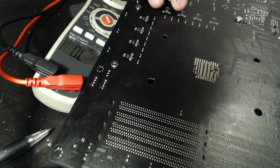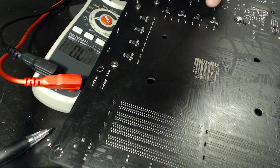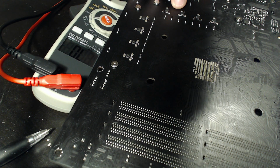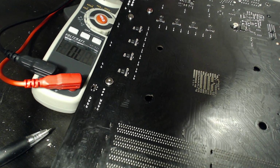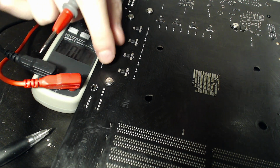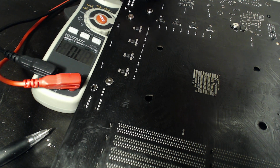And the first thing we need to do is identify Vcore. Now, we already know where the Vcore VRM on this motherboard is. You have these doubler driver chips right here. I think these are 3598s from International Rectifier. You have one PWM signal in, and then two drive signals going out of one of those. These four right here are Vcore, these two up here are also Vcore, and this right here is the SoC VRM, which is a doubled up 2-phase into 4-phase, and the Vcore VRM is doubled up 6 into 12.